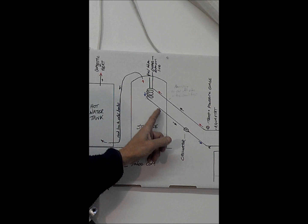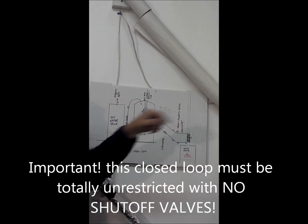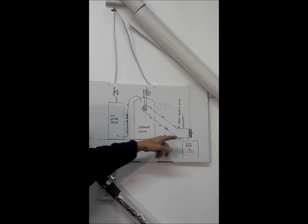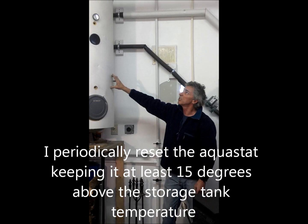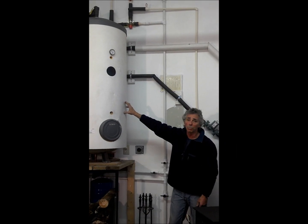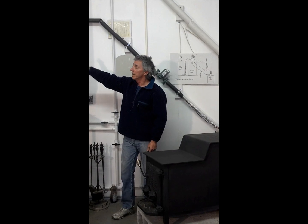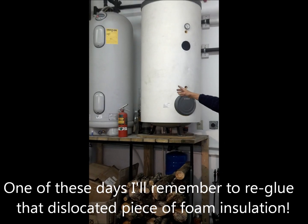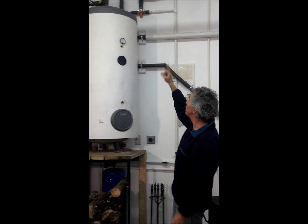The circulator is here. This time of year I run it with the aquastat set down to 130 degrees before it comes on. In the wintertime I've got the aquastat set for about 150 degrees, because there were quite a few days in January and February where, running the stove consistently, I would have in my 80-gallon Stiebel tank a full tank of 150 to 170 degree water. Normally it stays around 130 in conventional weather, but when it was really cold and windy and I was working the stove hard, I've seen 150 to 175 degree water. That in turn feeds into my hot water tank and tempers it well there. But if you're using a hot water tank rather than a storage tank preheating for an electric tank, you would definitely want the tempering valve.